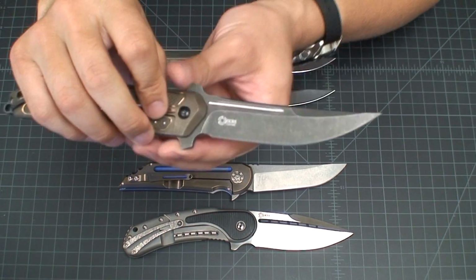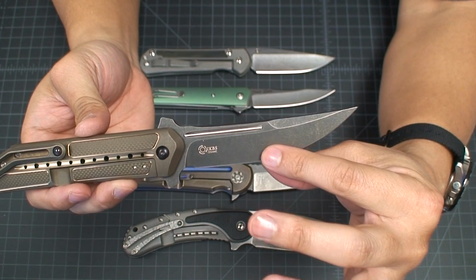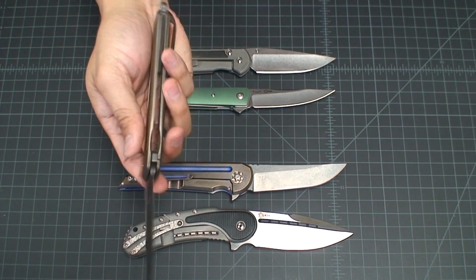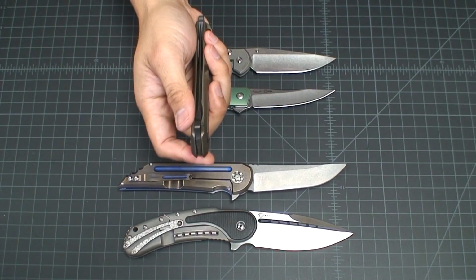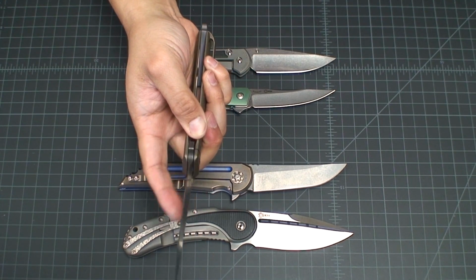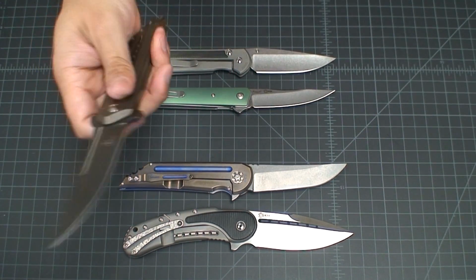This is a pretty lightweight blade. There's a lot that's taken out from this grind. It comes to an incredibly thin edge. You've got this swedge on top, you've got a fuller cutout, so it's a pretty light blade, and it just falls. A test for smoothness: if you engage that lock bar and push the blade up, this thing just falls so easily. Whether it's on the ceramic detent or on the IKBS, it just flies right out.